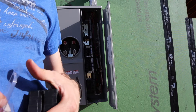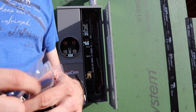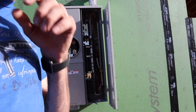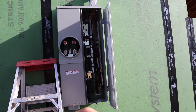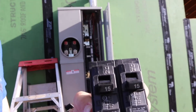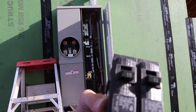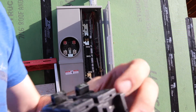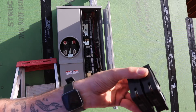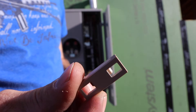For our well pump we need a double-pole 15-amp breaker, which is kind of hard to find. Running our well pump off at 220 volts only takes about seven or nine amps, so a 15-amp breaker is well within what we can use. However, finding a double-pole — meaning it connects to two different legs of the hot — is hard with a 15-amp breaker.